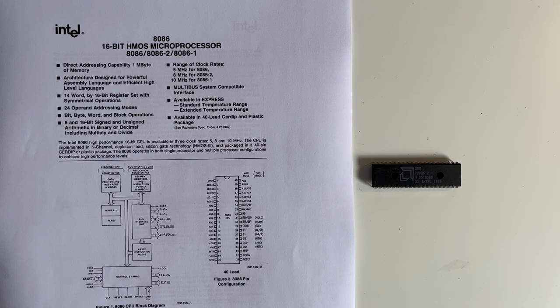So I want to run a clock rate of maybe one or two pulses per second. If it's running at two pulses a second then we can see exactly what's going on and how the microprocessor is reacting to the clock pulse. Unfortunately, if you try to run the 8086 at anything other than the clock speed it's designed for, it won't work.